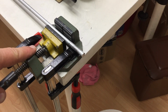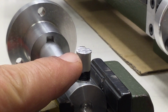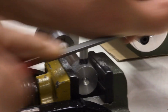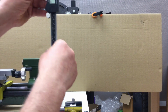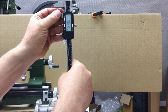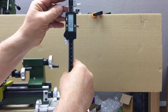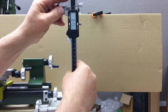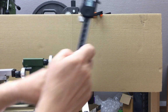And yes, this time I secured the vise properly to the table. And now for a bit of filing. Okay, we are on this side. I'm trying to get that right at 13.4, and on the other side also 13.4, so 0.4 more off.